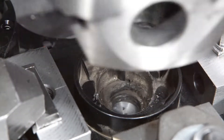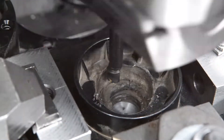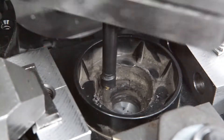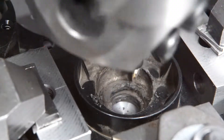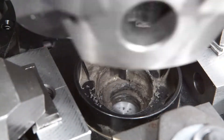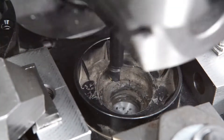Time for some milling action. I started with cleaning up the top surface of the housing around the bearing seat. The facing and boring head was set up for facing so that the cutter advanced radially by a few tenths of a millimeter with each rotation.